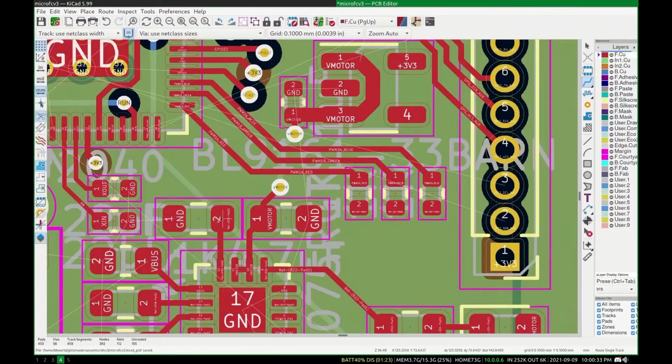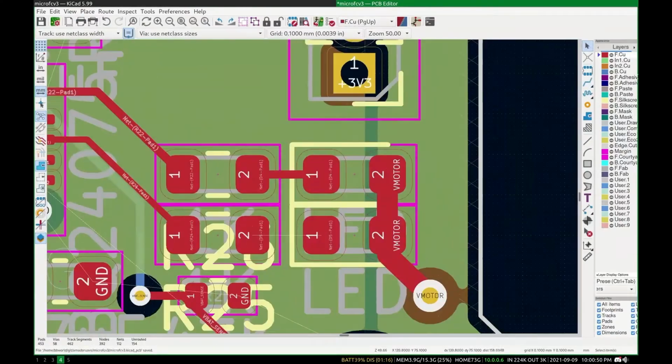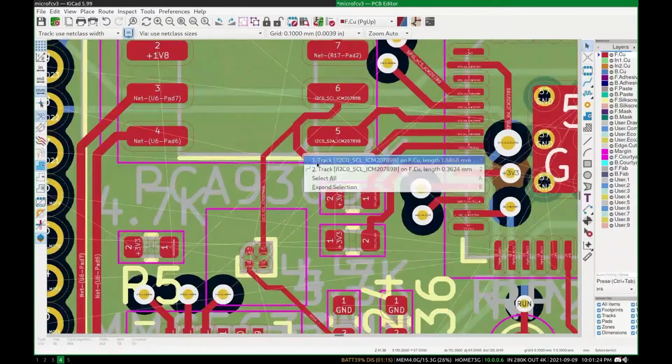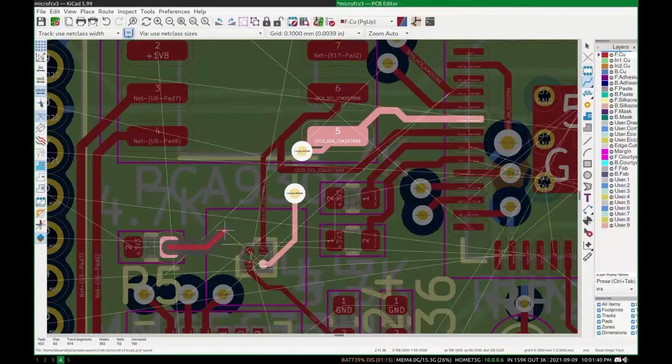However, this solution is not ideal for several reasons. The MPU-9250 and BMP-280 are both old sensors, and the usage of a breakout board adds weight to a very constrained drone. Work has already begun on a second version of the sensor suite, a new version of the flight controller, based on the ICM-20789 7-axis IMU and barometer combination, and the relatively new MMC5633NJ magnetometer, which will offer more accurate attitude and altitude estimates for a similar price. It is currently being designed at our club, although this version is not yet ready for presentation.